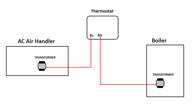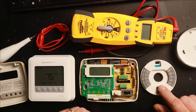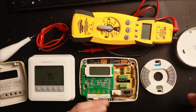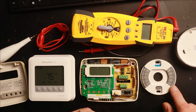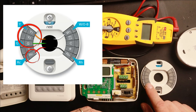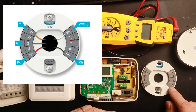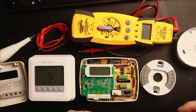In electrical, you don't want to cross circuits from one transformer with circuits of another. What that means for diagnostics is that the thermostat is designed not to make certain connections between certain terminals. For example, we have an RC terminal — C is for cooling — and an RH terminal — H is for heating. In cooling mode the thermostat only looks for power from RC, not RH. So in cooling mode you'll have connections between RC, Y1, Y2, and on heat pump thermostats the O terminal as well. In heating mode the thermostat looks for 24 volts from RH, and you'll have connections on RH, W1, B on some heat pumps, auxiliary heat, and emergency heat.